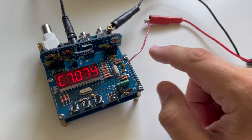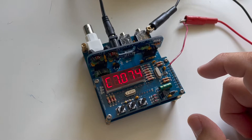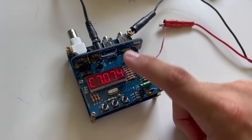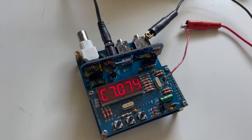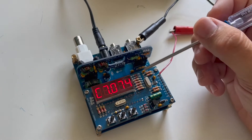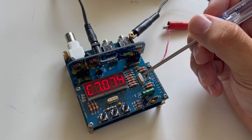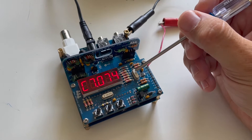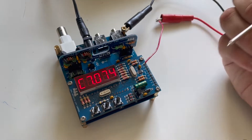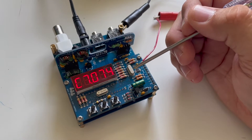On this little transceiver, I've added a jumper lead to pin C0 of the digital VFO board. When it's in calibrate mode, the frequency synthesized by this board and its partner crystal is fed out there. You can get rid of this crystal and swap in a temperature compensated oscillator — that's something I plan to do; I've actually got one on order. I forgot to order it when I ordered the kit, so I just built it with the standard crystal, just to see how it performs.